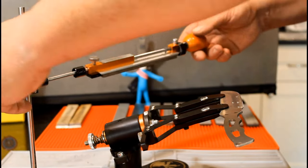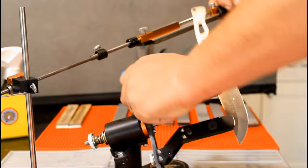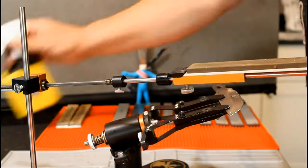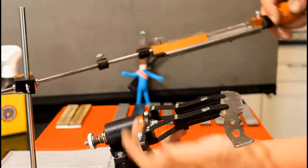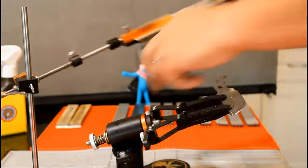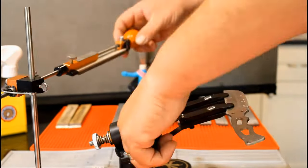With polishing stones, after making a burr on each side, try using 10 cutting strokes. Now 5. Now 2. Finish with the onesies on each side, then a stropping pass, and continue using the pencil.